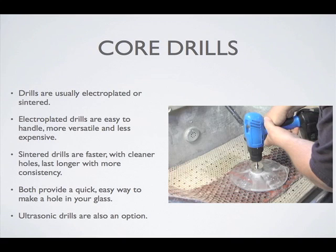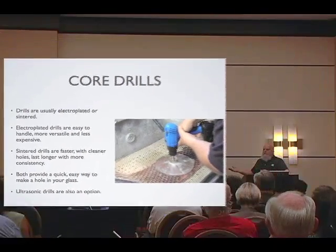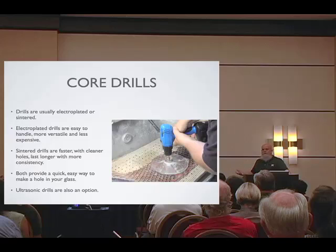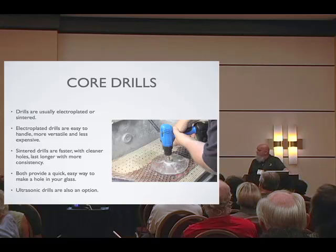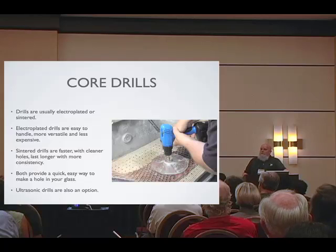Going through the back, there's always a big blowout — little chips of glass on the back. If what you're drilling through is flat, here's a good opportunity for a piece of glass waxed to the back, so your blowout happens on that. You heat it up with a hairdryer or hot water, slide off that glass, and you've got a perfect edge. By hand or with a drill press — drill press is always better. The way you're wiggling it, that's a good way to get it jammed in there, which will crack the glass, get it stuck, and bend your core drill. Then whoever you buy your core drill from is getting the advantage of your careless drilling.